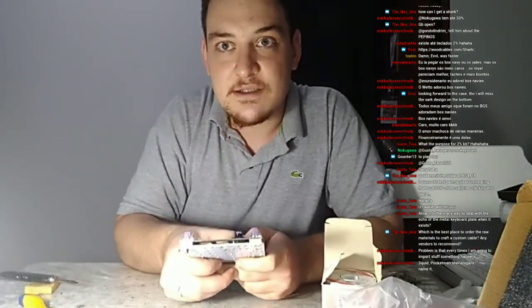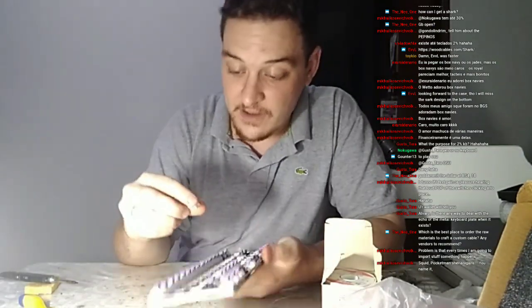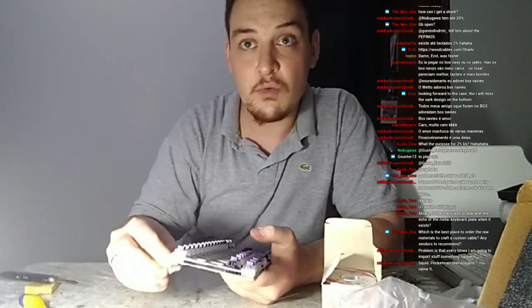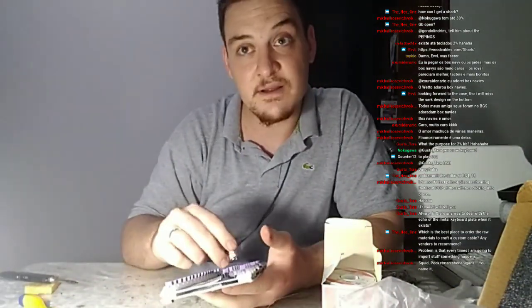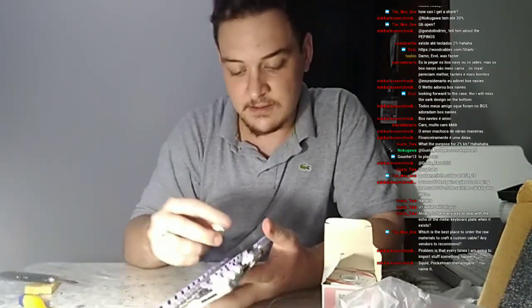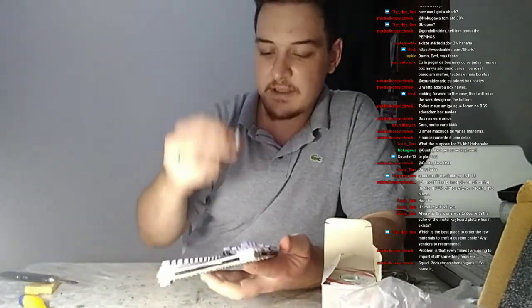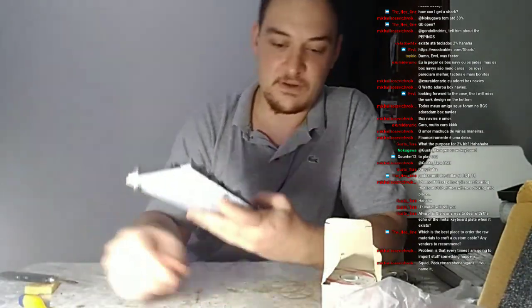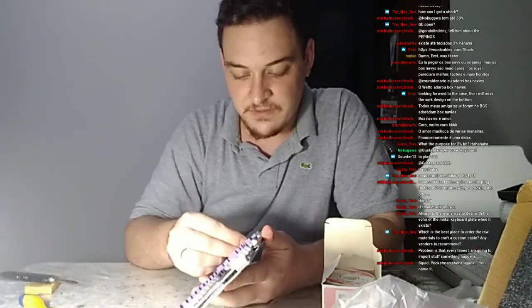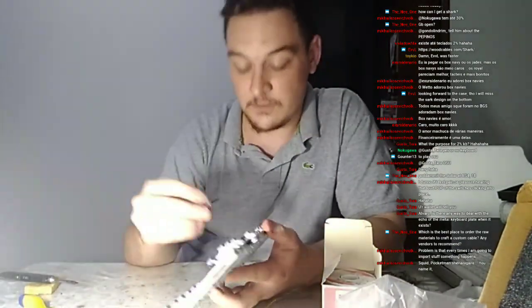Is there any other way to deal with the echo of the metal keyboard plate when it exists? So there are alternatives. There are people that use a foam between the PCB and the plate. I've heard that that helps. The other way would be, if your keyboard is a tray mount, you could add rubber O-rings on the screw points so that the metallic sound doesn't echo as much. You can also always do that.